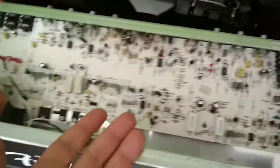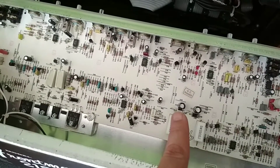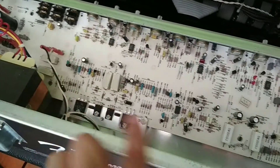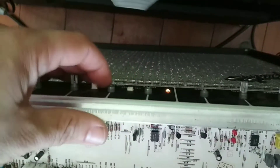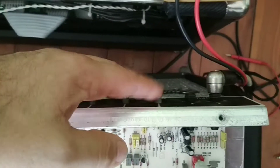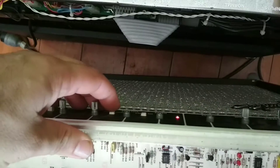Thanks for watching, please subscribe. The amp is now fixed - sorry I didn't video the repairs, but I gave you a rundown of what I did. These resistors were replaced, that diode was replaced, these resistors were replaced, and the amp is now up and running. And the channel selector works - so clean channel, dirty channel, and more dirty channel.